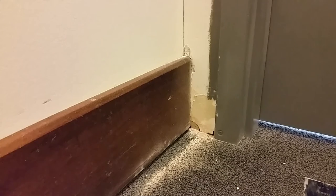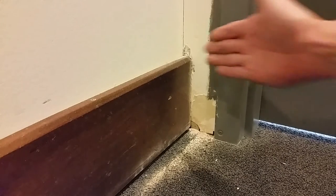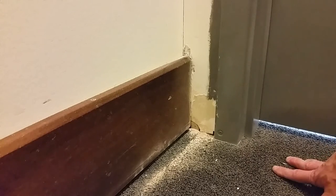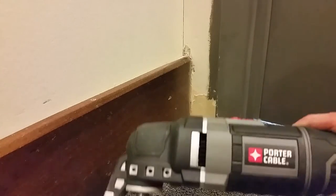There we go — it took me about six or seven minutes to cut through that. A lot easier than it would have been with any other tool. We discussed doing it with a sawzall, but you know how a sawzall is — it would have cut way through, and I'd have had to angle it severely, leaving a much bigger hole to patch. With this tool I was basically able to cut it off flush with the wall, so now it just needs a coat of spackle or mud.